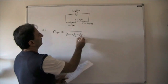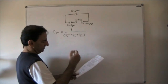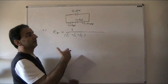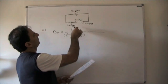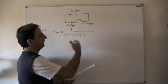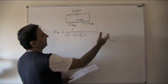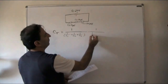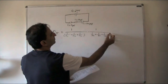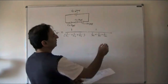The formula is CT = 1 over (1/C1 + 1/C2 + 1/C3). Make sure to put the denominator in brackets so your calculator doesn't make a mistake. Because all values are in microfarad, no unit conversion is needed. Substituting: 1 over (1/50 + 1/50 + 1/100), and the result is 20 microfarad.